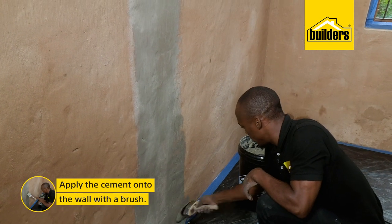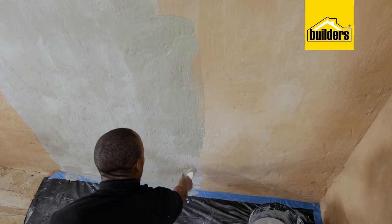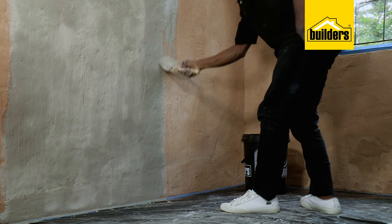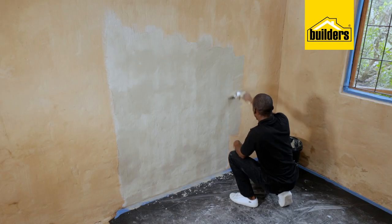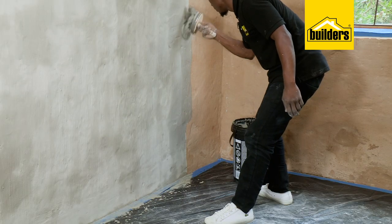We want to see the bristle strokes, and if your plaster is a little on the rough side in certain places, don't worry about it. It's going to look great after it's been bagwashed — remember, that rough look is exactly what we're going for. Bagwashing can be applied not only to plastered walls, but also on rough bricks and rough concrete.